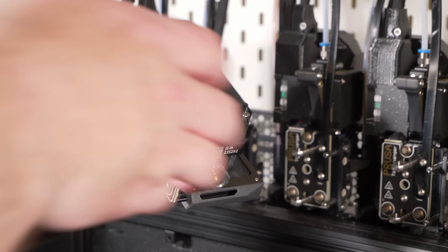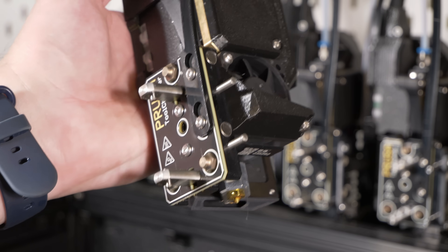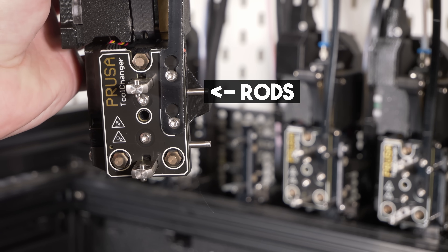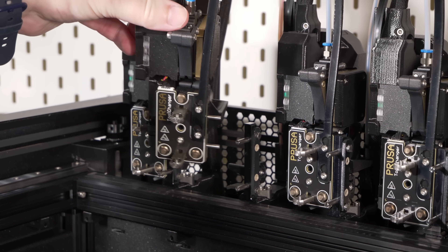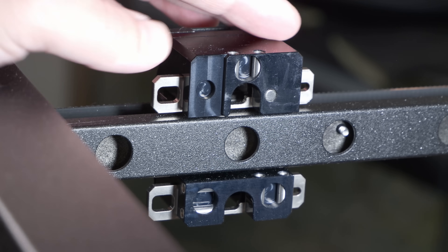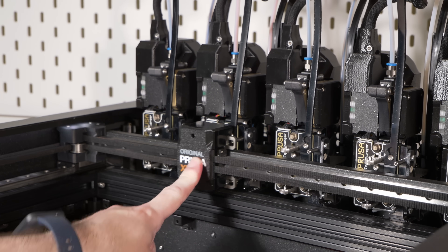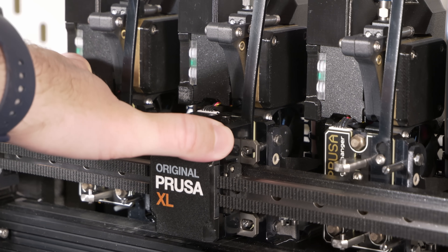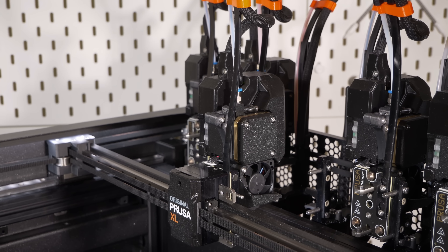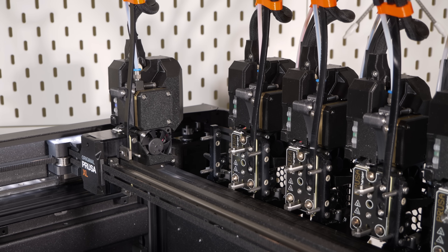On the XL they're mounted sideways and don't have the same logo on the front. The whole point of a tool changer is that it changes tools, and you're probably wondering how it does that — that was my main question about this machine. The tools are held on rods with magnets at the end of travel to stop them slipping off. When mounted to the tool head, two metal bars slide across to lock into position. Once locked, it pulls away from the magnets and detaches. This is an entirely mechanical process driven by the printer's own kinematics — there are no motors or solenoids in the head.